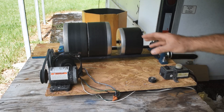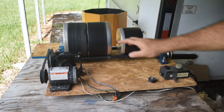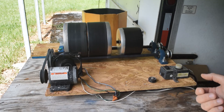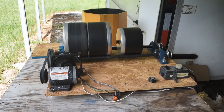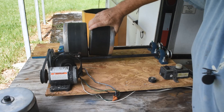This one is much higher capacity. I'm not even using it to its full capacity — I could get two more six-pound barrels on here, or a 12-pound barrel, which I just might do in the future. Right now I've got two six-pound barrels and a four-and-a-half-pound barrel on here. This tumbler has been running continuously for a few weeks now. I thought I would show you how it's going, the minor problems I'm having, and a modification I made based on a suggestion from my buddy Jim, who is my mentor in all things lapidary.